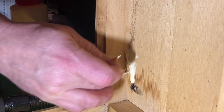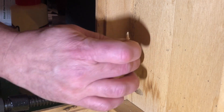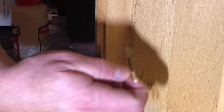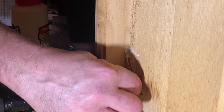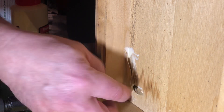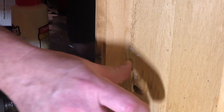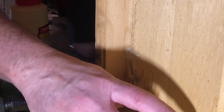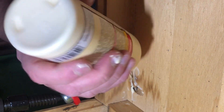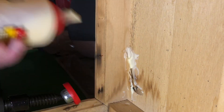It's important because this is a pocket hole — an angled hole drilled in here to hold the top. There's no tenon or anything, no piece of wood that comes up and fits into the tabletop. So if this chip doesn't get glued back together, the tabletop isn't going to sit right; it's gonna flop around. I don't want to hand off a piece of furniture to somebody where it's kind of like a limp fishtail bouncing around.